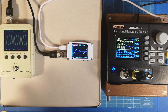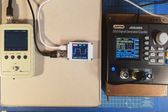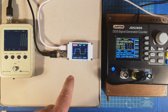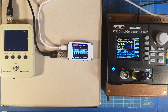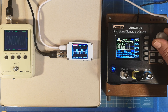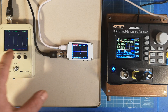In my opinion, 300 kHz is the practical maximum for the DSO-188 where you can actually interpret the waveform. On the JTech, 100 kHz or lower is better. Now changing to square waves: at 100 kHz the JTech struggles and shows something sine-like, while the DSO-188 still shows a recognizable square wave. Going up to 500 kHz, the JTech is very bad and the DSO-188 also has trouble displaying it properly.